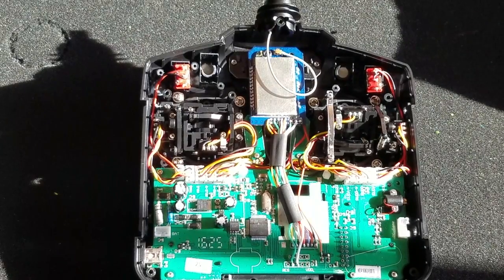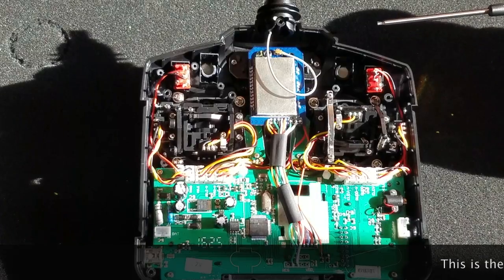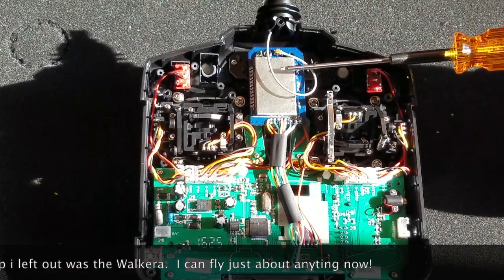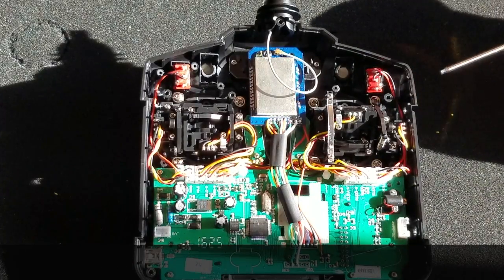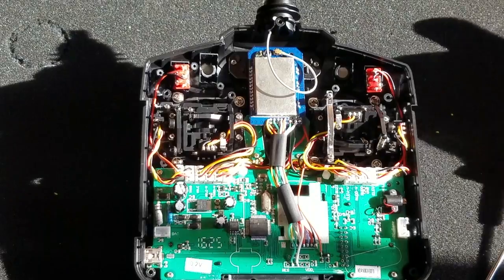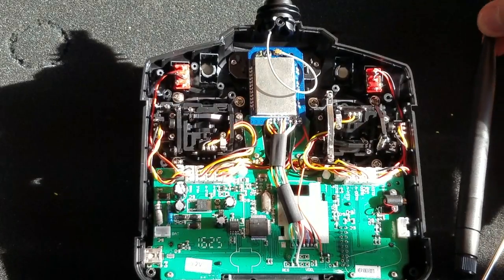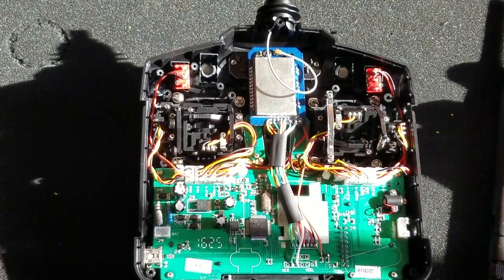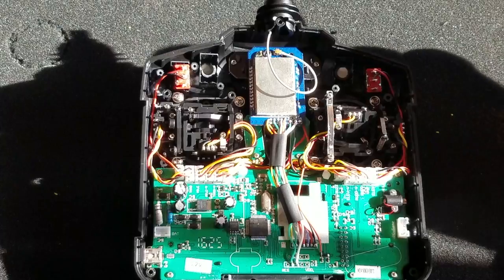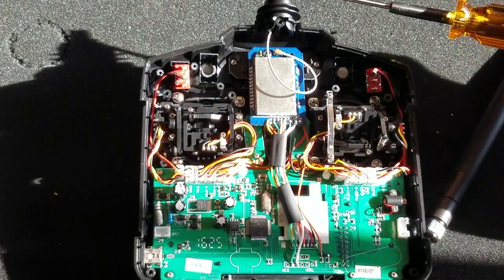If you're someone who likes simple, this might be a good radio for you. The module comes from Banggood — I'll include the link in the description. What's neat about this module is it has a UFL to SMA or RPSMA connector depending on what cable you buy. For whatever reason, it's a pain to get an SMA version stateside — they're all RPSMA. So when you buy your UFL connection, if you don't want to wait for shipping from China, just buy a RPSMA UFL to RPSMA connector.